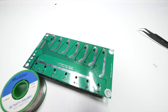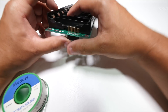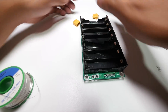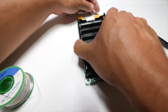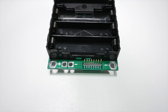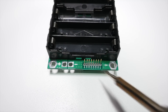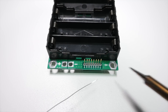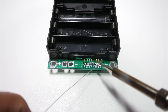There we go. Next thing is we're going to solder this little pin here. You want to install it on the back side. Make sure this is straight — right now it's at an angle. You use XT60 connectors. Another important thing is to have a small tip because this is kind of fine work; you don't want to create big blobs of solder.